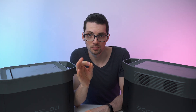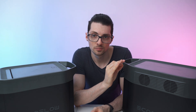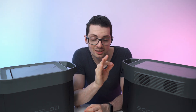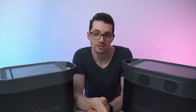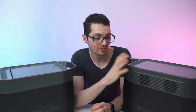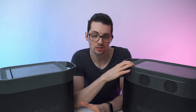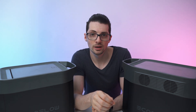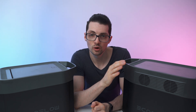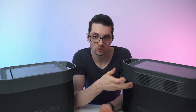The actual worst problem is this: using this all the time, even when you don't need it, will degrade the system over time. Even though this takes a few years, this degradation will cost you so much more money than just paying for the electricity. So in my case, except for rare occasions like camping, I just have it to be safe in case of an actual blackout. I keep my batteries stored at around 50% charge level, and if something happens, I'll hook up my solar panels and my fridge to the main unit. With almost 800 watts of power, this should be good for my fridge.